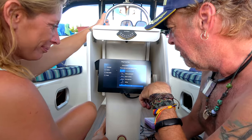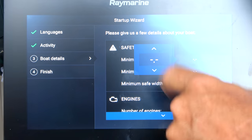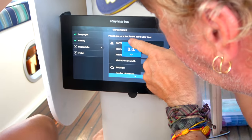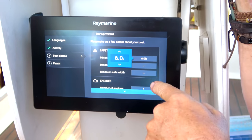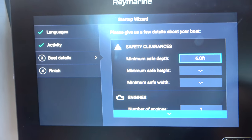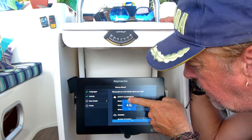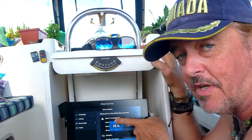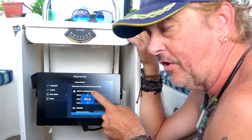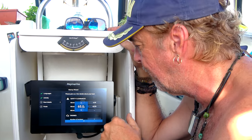We start it up — got English selection, fishing/salt water/motor cruising/sailing — so yes, sailing. Minimum safe depth: obviously we require at least two meters or six feet. We'll set that as our draft for now; we can change all that after the fact. Maximum safe height: that's for bridge clearance — our bridge clearance height is basically 65 feet. There have been times I've needed to know how tall a bridge was to get under it. I've done a lot of inland locks and systems before. The Panama Canal that we're going to be going through has bridges, but they have much more height than 65 feet.